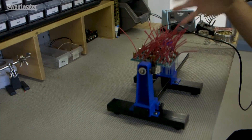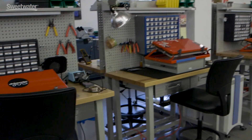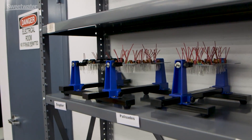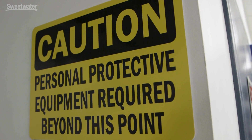We're not actually doing any soldering here, but as you can see it's a fully populated board with wires and all. We're now in the main production aisle where all of the boards get populated. You can see all of these orange machines and all of the parts bins in front of them. At their station, a builder will take the corresponding build sheet and begin taking components right out of the bins, dropping them into the corresponding location.